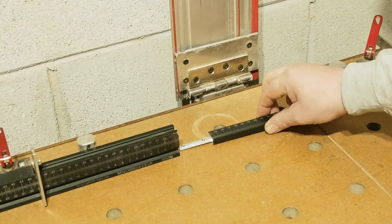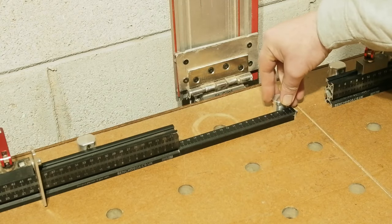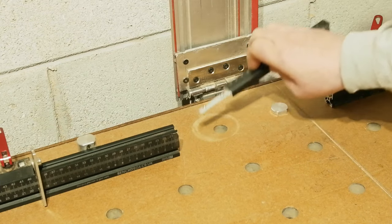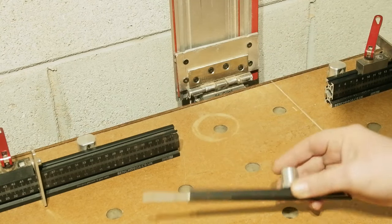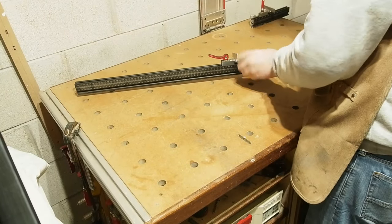The under rail being just 9mm by 20mm — I always recognised as a weak point. Although my addition has the under rail attached via a connecting bar, I don't think the newer one-piece version will fare any better. We're still talking about a 9 by 20mm extrusion jutting out of a 2040 profile fence, and with the best will in the world, kit is going to take a knock eventually in busy workshops.